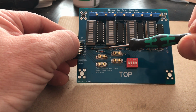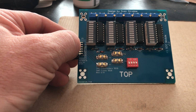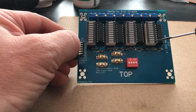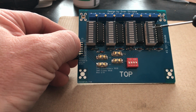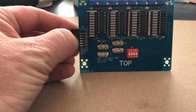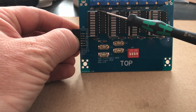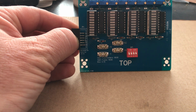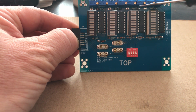Also, I have to mention this resistor here, always on the bottom of the LED bar graph. This is only necessary if you use the SOC module as a 1 bar readout. 1 bar readout means there's only 1 bar going up or down if the voltage of the battery pack goes up or down. You can also use it as a full display. Then, I hope you can see it on this video here, you have jumper 1, jumper 2, jumper 3 and jumper 4 for each channel. If you solder this together, you can use it as a full bar readout. But then again, the consumption of energy goes up, and the board uses more amps. Later in another video, some more explanation when I test this out.